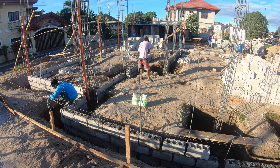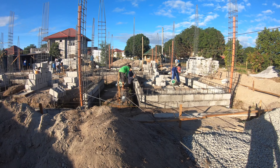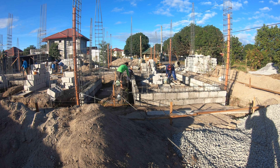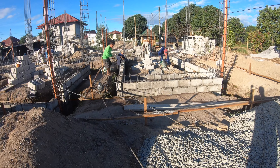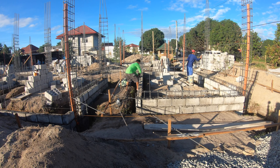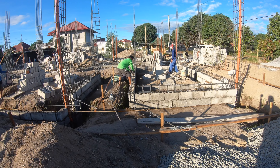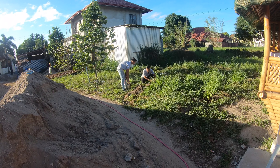A little bit at a time, the floor plan is being revealed. Mr. Orly and Mr. Manny are starting to put in another one of the grade beams. The first thing they do is line up where all the stirrups are gonna go, then they'll put the rebars for the top and bottom of the beam into place through those stirrups and spread them out to the appropriate locations already marked. Mr. Orly had already gone out with a tape measure and marked the appropriate locations for the stirrups.